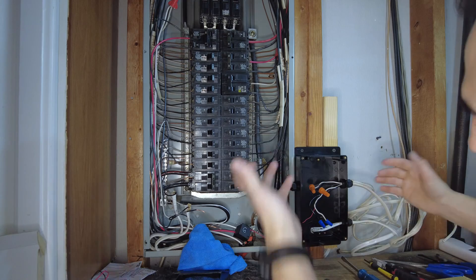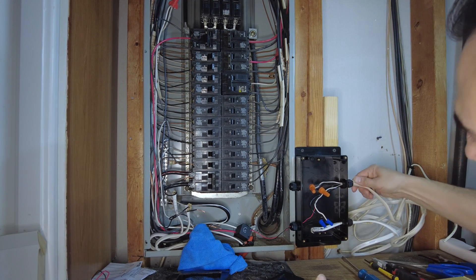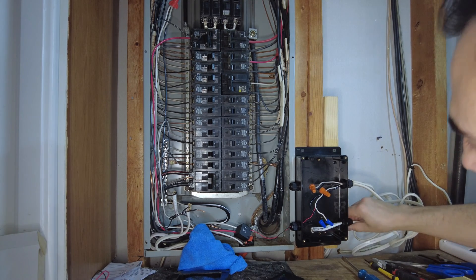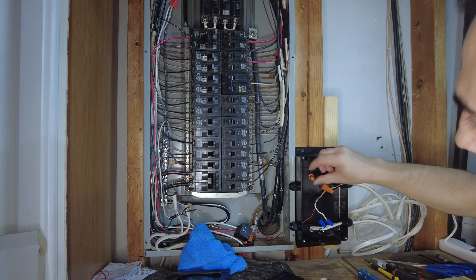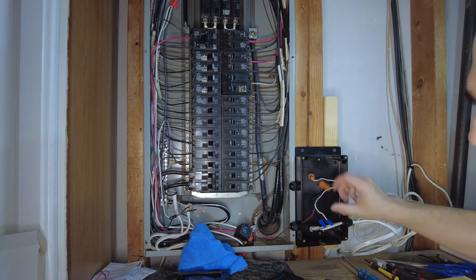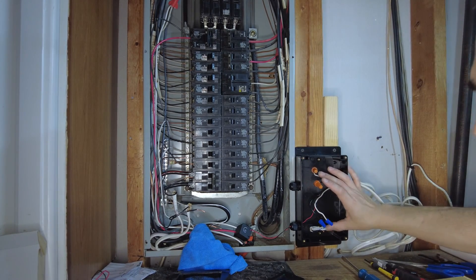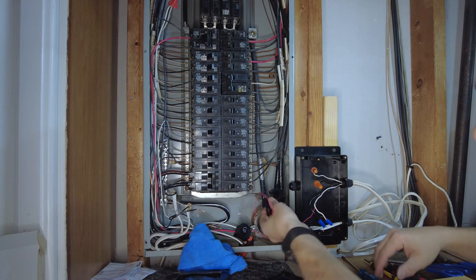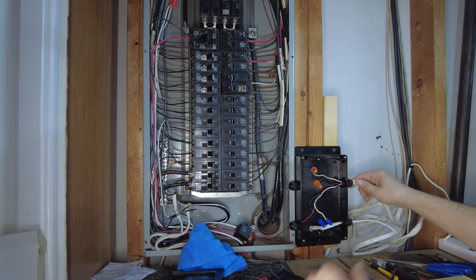The box only comes with four cable glands, so I had to make two cables fit in one hole — they barely fit but it's snug once tightened down. The generator wire is by itself down at the other hole. I put lock nuts on there to show me which wire is A or B for routing, just for good safety. I placed the box low on the panel because I plan to put the current transformers low in that area.